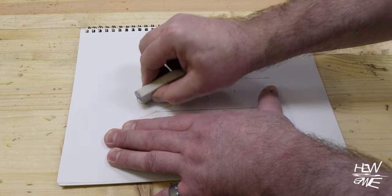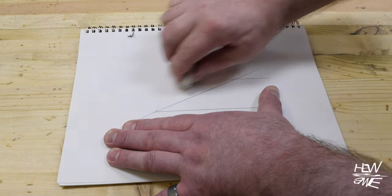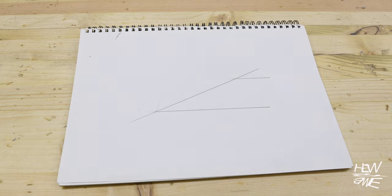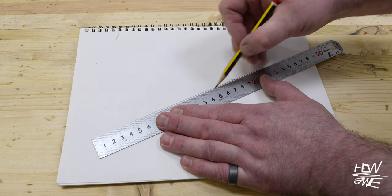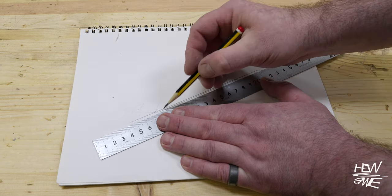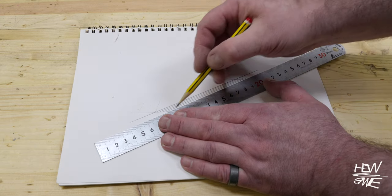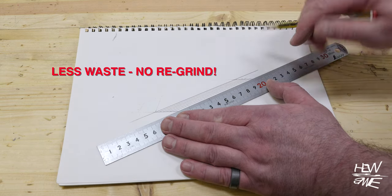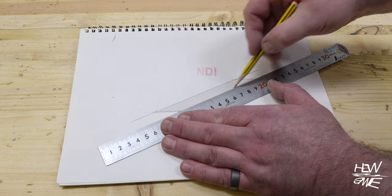I know it's a contentious issue at the best of times, but I'd like to know, why is a secondary bevel a thing? Why not have a primary bevel only, set to the degrees of the usual secondary bevel, and honed to mirror finish? And then just keep honing that, negating the need to spend a good part of the day regrinding said chisel. On your mark.